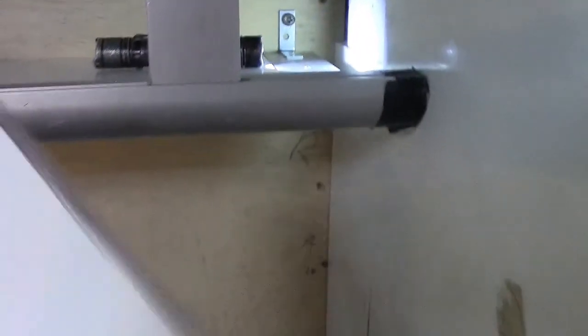So, that is how I am making a fill-in panel to go in there. I will then take the cupboard down. That end profile there will slide into that slot, hold it straight, and then every other edge will get Sikaflexed in place once the cupboard goes up for the last time, which will be after I put the wall lining in. And I just keep sanding it until it fits.